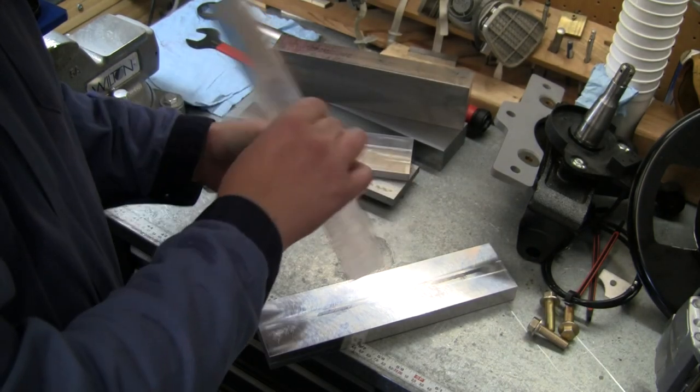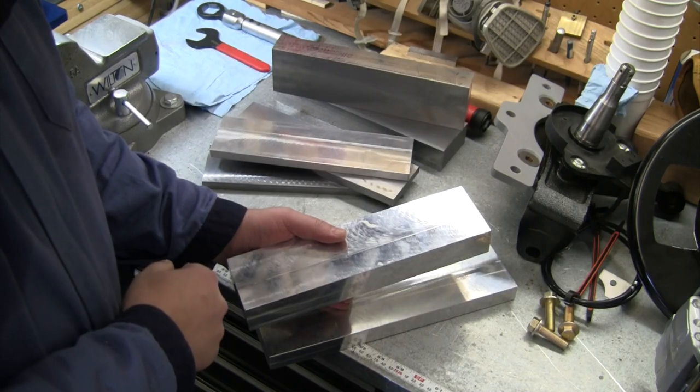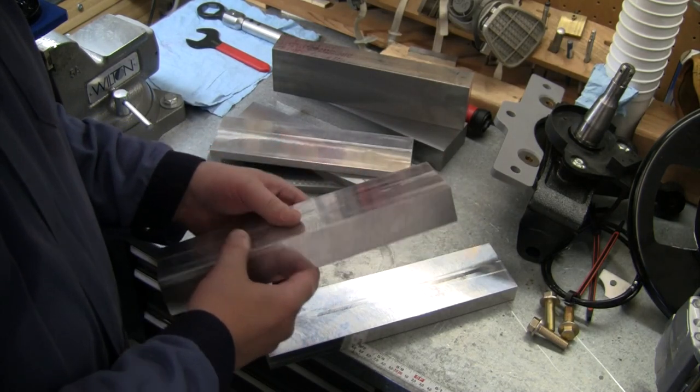We've got some dowel pins. We'll flip it over. We'll clamp that, bolt that onto our jig plate, and then we will finish the contours on the other side. And unlike the prototype one, we've got a couple of bosses. You'll see those when we go look in Fusion and get a better look at this.